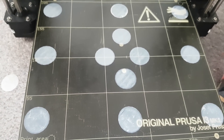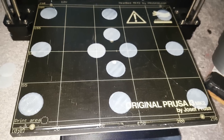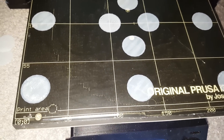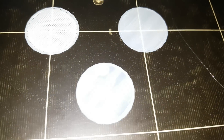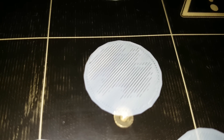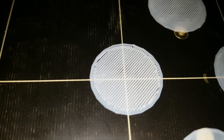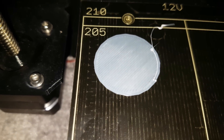This one has finished now. I live adjusted the Z to 25 microns lower — so the nozzle higher by 25 microns — and it's definitely made a difference. These are the front ones and look at those: there's a tiny bit messed up there but nothing anywhere near as bad; that one's actually really nice and that one's not bad at all. In the middle here, that one is really nice, that one's perfect, but there's that weirdness again where it's almost as if the filament doesn't stick or doesn't smush down in certain bits.